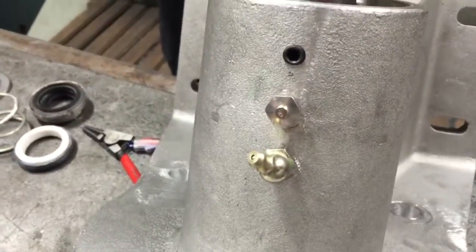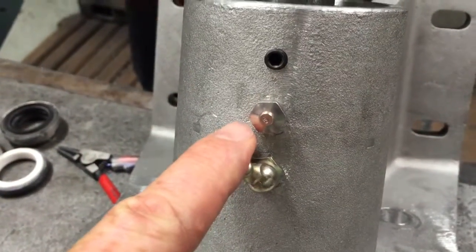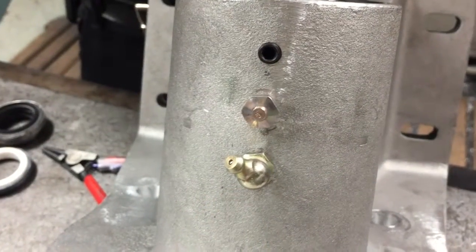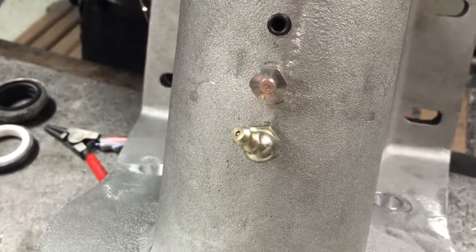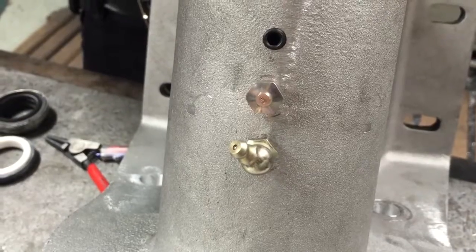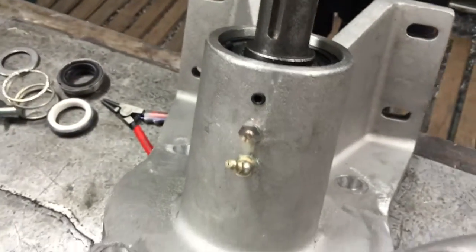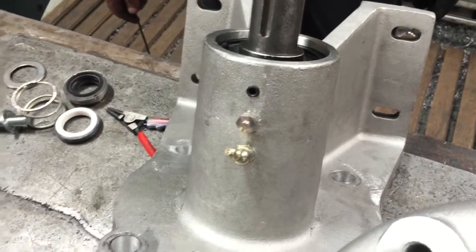Since we're right here, I'll show you what we have. You'll notice the two zerk fittings on top — this is a zerk check valve where grease comes out but doesn't go back in. This is where you put your grease in. It's very important that you only grease your pumps maybe once a week and do not over-grease. If you over-grease, you're going to blow the bearing caps off. That's the black part right here. It's best to do this at the end of the day or when the pump is good and warm.